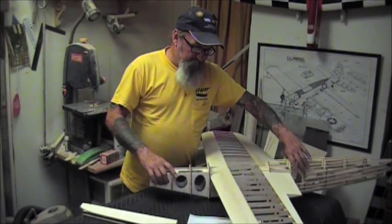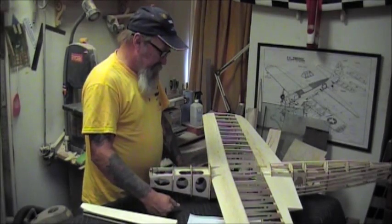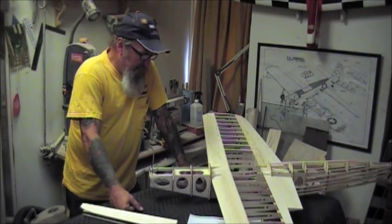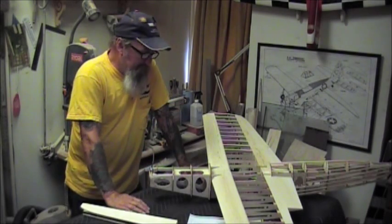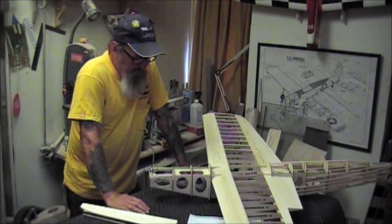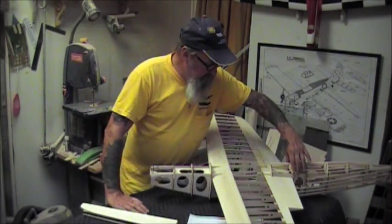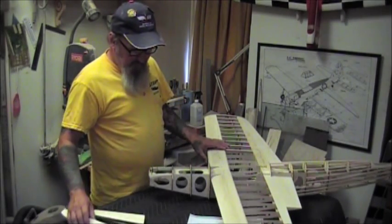On this particular airplane you have to finish the fuselage with the wing in it, so the skin goes on after the wing is in - it all fits together tight. It's a super nice kit, just unbelievable. Every piece went together perfect. There were a couple of things I had to make note of that were off on the laser cutting, but once I get that off to John it should be revised when the kit is released - only in two places and I'm sure it was just an oversight. Super straight - I used John's wing jig and it came out super straight.